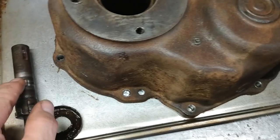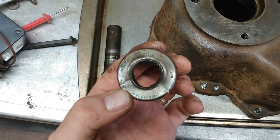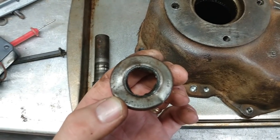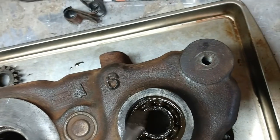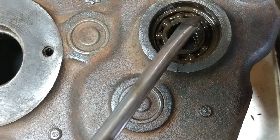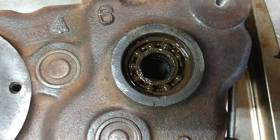Got the input shaft out and it's got some shiny places on it — it doesn't feel too bad but it needs to be cleaned up real good. There's the oil seal and I had to destroy it a little bit getting it out. Hopefully I can match that up at my parts store or tractor supplier. It's a three-quarter inch shaft — three-quarters inner diameter and inch and five-eighths outer diameter. You could tell it was oblong and you could tell where that shaft was wearing on it. One of the balls is missing from the bearing. I need to get the dimensions to find a replacement before I tear into it further.